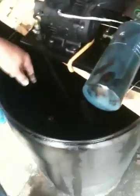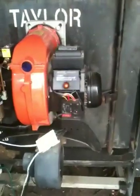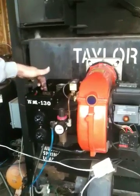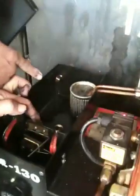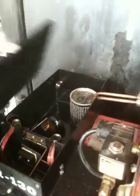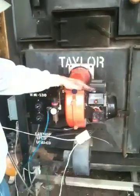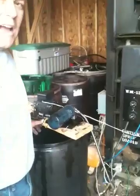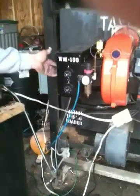In our oil container, we have another filter. So having dirty oil is nearly impossible once you go through these three oil filters. This light here will come on when oil is needed in this chamber, and I can actually stimulate that by pushing the float switch down — you can see the oil coming in right back here as needed. This is a totally automatic system that really requires no input other than having a small air compressor, electricity, and clean oil. If the oil is not clean, you can separate it by opening a valve to let any antifreeze or water out.